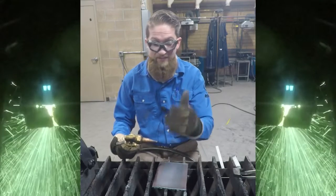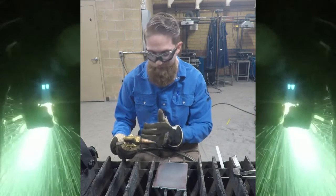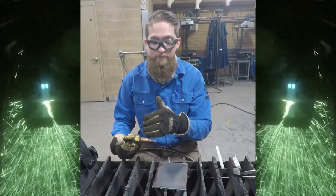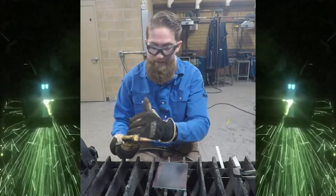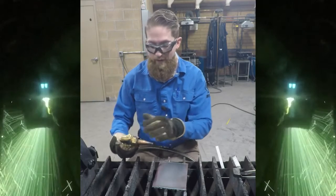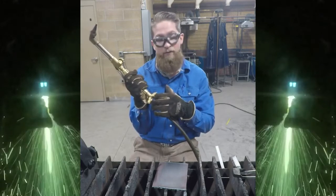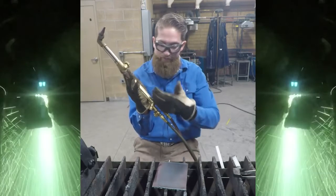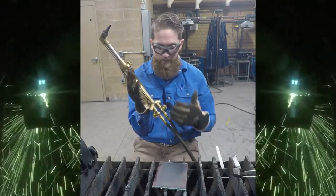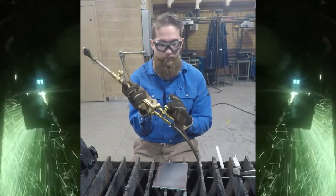is where you have a sustained burning of oxygen and fuel inside your torch. It'll often sound like a very high-pitched whistle. And so if that's burning inside your torch, the torch will start to heat up rather quickly. Most torches are built in with flashback arresters, meaning that they are going to stop any fuel and oxygen mixing going the opposite direction. Some older torches don't have those safety features, but you can buy and make sure that you put those on there.